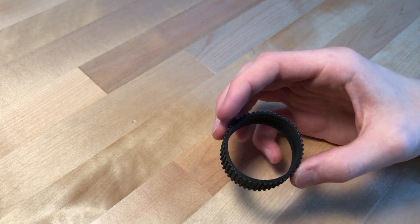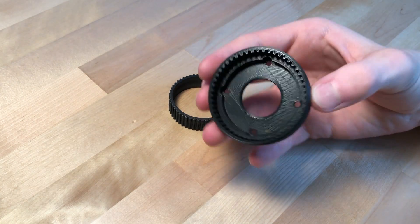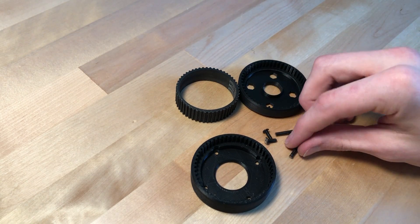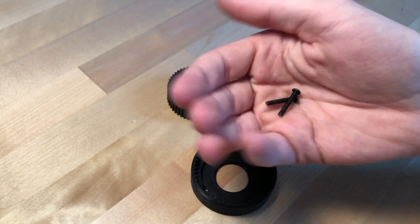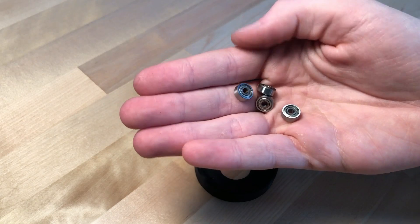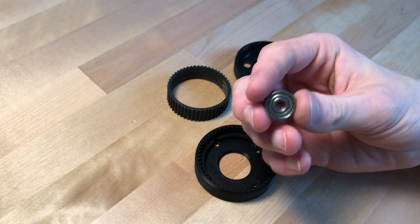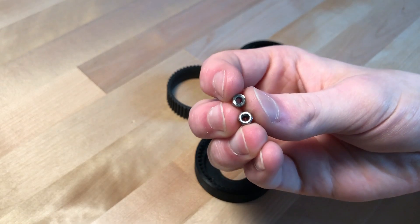The design is mostly 3D printed. The pieces start with this belt, of course. This is the bottom of the harmonic drive and this is the top. I have 4 M3 screws — two to mount the harmonic drive to the motor and two for the mechanism. These two are 6 millimeters long and these two are 18 millimeters long. I have this internal bar which will go on the shaft of the motor. I have four bearings, each with a 3mm bore, 10mm outer diameter, and 4mm height. Then I have one larger bearing with a 5mm bore, 16mm diameter, and 5mm height.